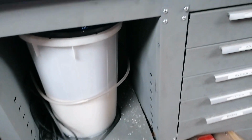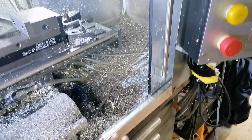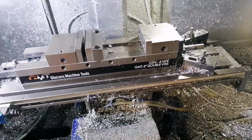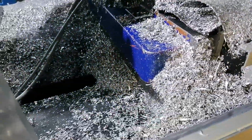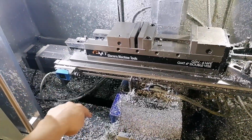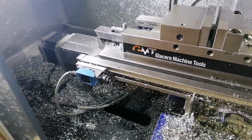And here we've got the coolant. So with the new steel part that I made, it's a big trough. I did clean some of the machine, but I left some of it natural. Just we've been doing a lot of milling recently. So this slopes down and pushes anything under the mill, so the mill's actually up on some bits of steel you can't really see, but there's quite a big cavity under there. And then here is the hole where everything passes down into that bucket, but all the sides are angled. I learned that quite quickly, that stuff will build up if it's not angled, so you want angled sides.